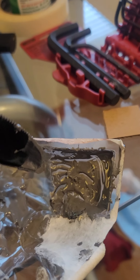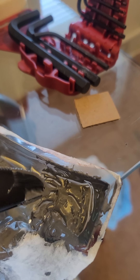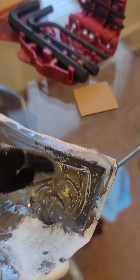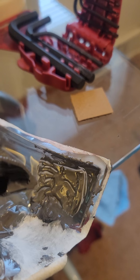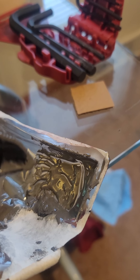Run a knife through your JB Weld — see how it's sticky like that. If you look carefully, you'll see it's starting to level off; it's still very runny. You have to really watch it. Wait just long enough where you pull the knife up and the little strands that stick to it lay on top of the glue or resin — that glassy look. You want to wait just before it slowly sinks in, because it's getting really close to setting up.